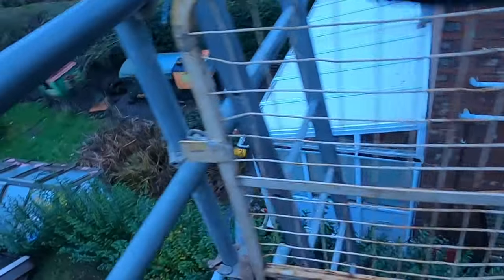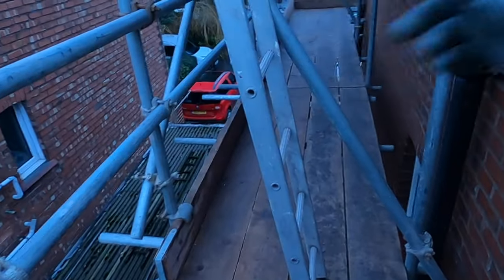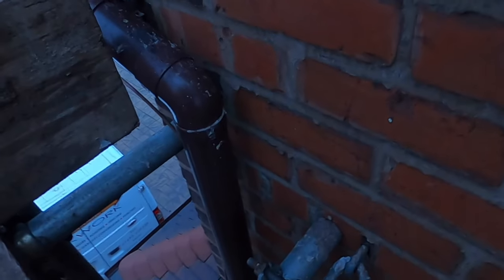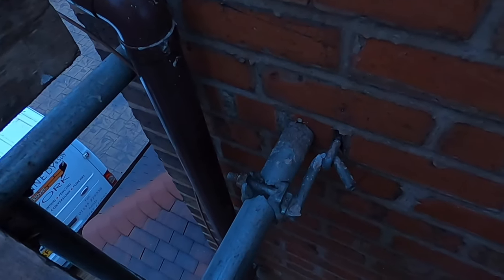Cracking scaffold this, made up with it. You couldn't get any the rake stabiliser bars in, don't know what they're called. So there's a couple of, show you, never seen these before. He's anchored it with them. We screwed two of those eyes in, one at each end, and that's anchored the whole scaffold. It's a solid job.